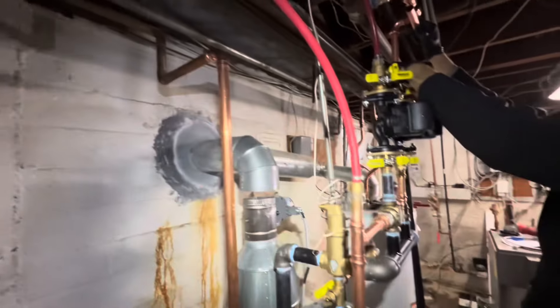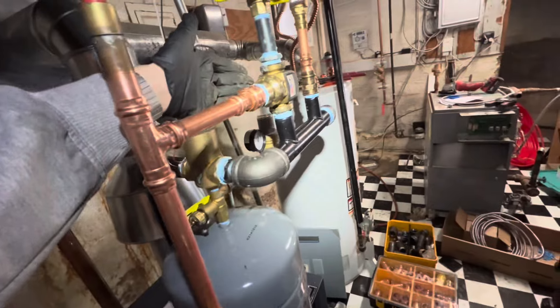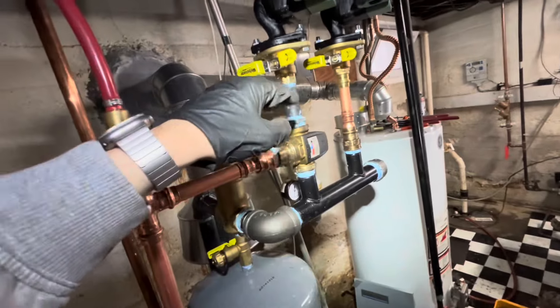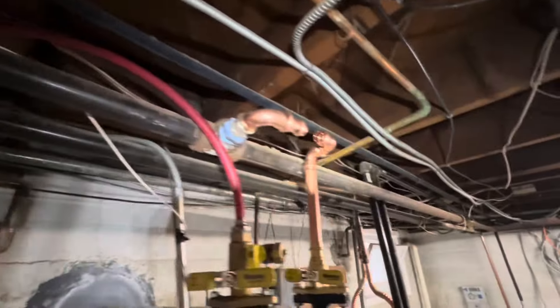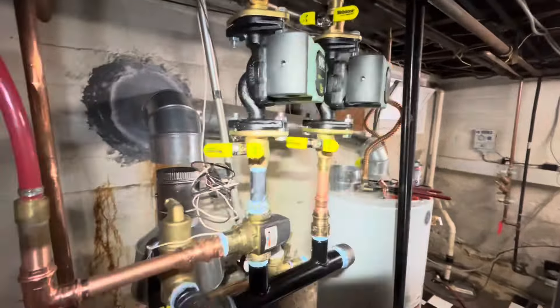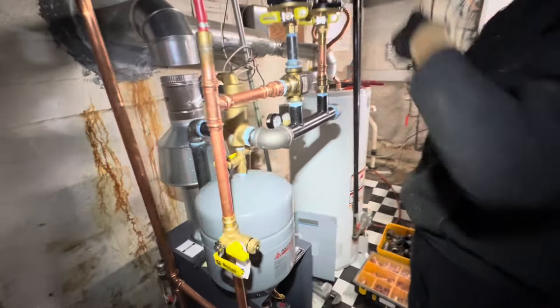Here's what we have on that. Our main return line comes down. Our radiant return comes in and goes into there as well, but it also goes in here so that the pump can pull some water from the return and some water from the boiler, so that it's not overheating the floor of the radiant zone. We're just working on our connection up here. These are circulators — leave them at an angle so you can access the screws and the wiring. I still got to put that piece on the exhaust, get the zone relay put in, and gas as well.